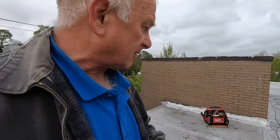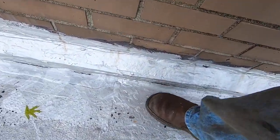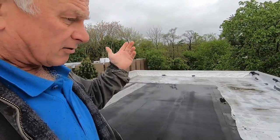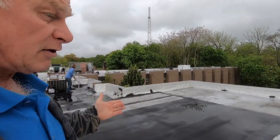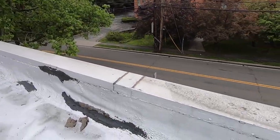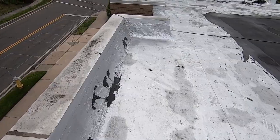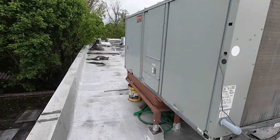Every time they patch, they think they found the leak but they look at the wrong place. I'm going to show you where to look - see the water coming out there? Torch down is the best type of roof, but if it's not done right, any roof is going to leak. They have three or four layers of torch down and still couldn't find the leak. It's because the torch down never went up the wall. There's nothing up the wall - this is paper cracking open. They just went to the bottom and that's it. The parapet wall is part of the roof - you cannot stop with a roofing membrane at the bottom of a parapet wall. That's where most leaks occur, because of the parapet wall and the flashing.